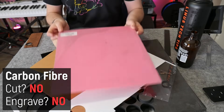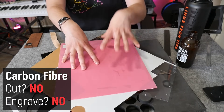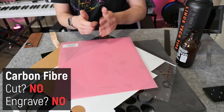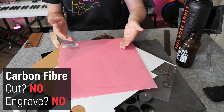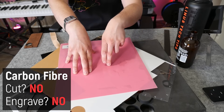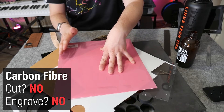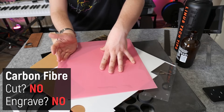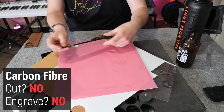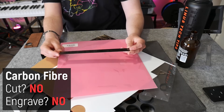G10 is a material I've been using on my 3D printer print beds, but you definitely shouldn't laser cut it — not only is the epoxy a thermoset material that burns instead of melting, but it has fiberglass in it. The laser cannot cut it, so do not try to laser cut G10 or anything with fiberglass in it, because not only will it not work, it will probably cause a huge amount of nasty fumes. The same goes for carbon fiber — those carbon strands won't laser cut.